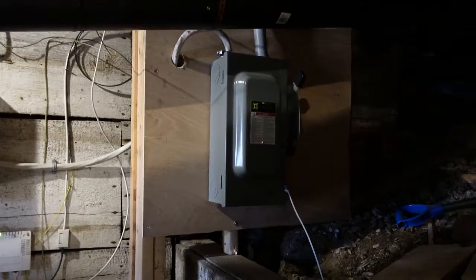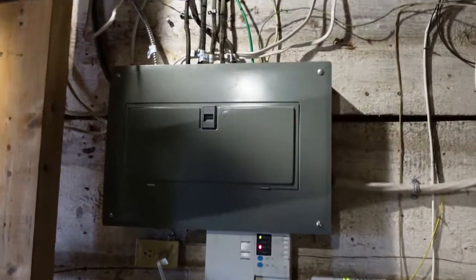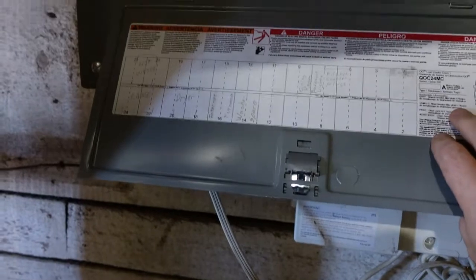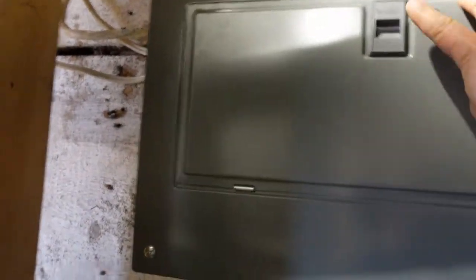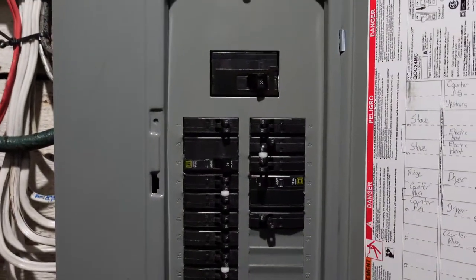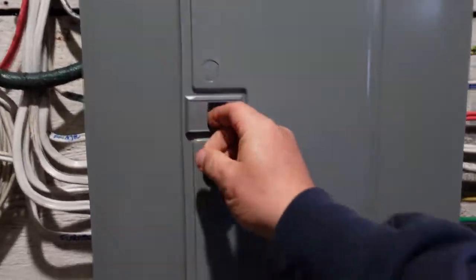We're back and we have the service upgraded. Our meters have been moved over to our new 100 amp per position meter base, and as you can see at the top of the service it's all hooked up — the power utility came over and hooked it up for us. You can see our disconnect and then our new 100 amp panel with everything tied in, all breakers put in, all marked — that's one apartment. And here we have our other electrical panel on the other side, 100 amps with the main turned on. There you have it: one completed 100 amp per position service with 200 amps coming in.